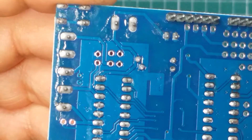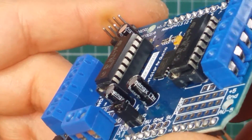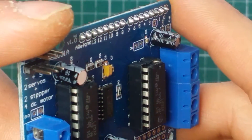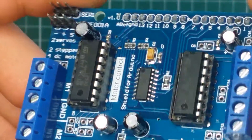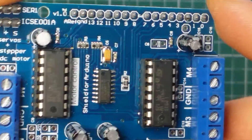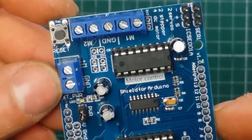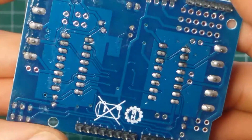All in all, it's not bad — apart from the capacitors. Putting a non-brand capacitor isn't going to cost that much, but the most important thing is the voltage rating on these capacitors is not within the spec of the ICs. Even in their own description they've put up to 25V, and these are 16V capacitors, so that is not good. But other than that, it's decent — it's much better than the other stuff I've seen from China.